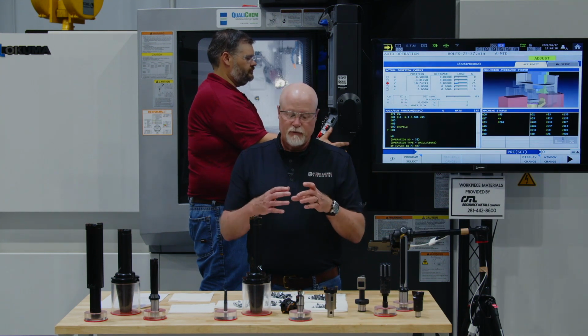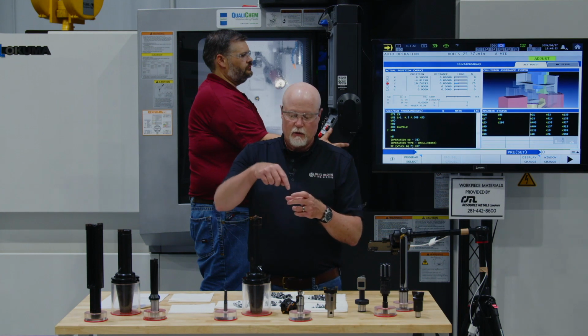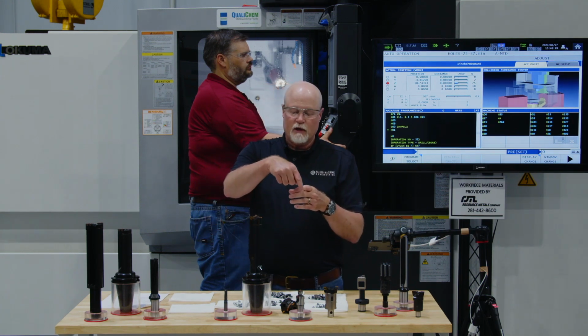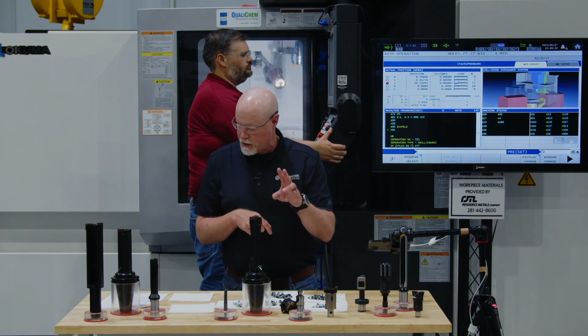Now where we just ran that Vortex and then the twin cutter, we're going to put 3 holes, in a triangular shape, around that hole, kind of like what you would do for a bolt circle, for example. We're going to use that TA Pro P geometry to drill all 3 holes, once again going 3 inches deep.